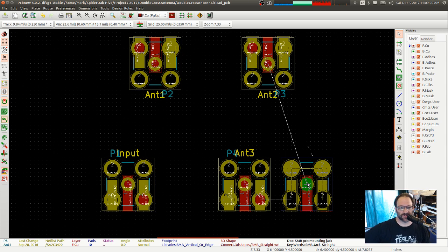Let me go measure my 2-inch PVC. Stand by. Okay. It's on. It's zeroed. What is the maximum horizontal space I'll have here? Looks like 1.6 inches is the internal dimension on my PVC. So long as I keep the total board dimensions to be less than 1.6 inches, and it'll probably be closer to 1.5 just to make sure I've got the space.